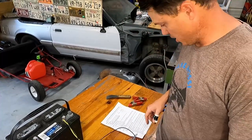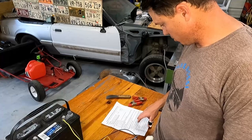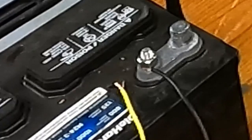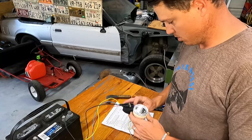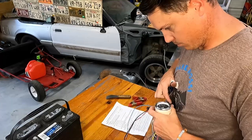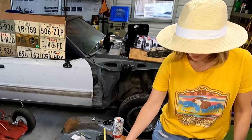You hold P1 down until it changes to solid blue. Then press P2 or P3 to move the gauge pointer to empty. That should be with this thing facing nothing. It's already at empty. My grounds came off — let me redo this.